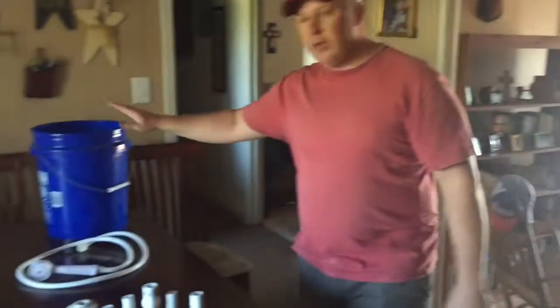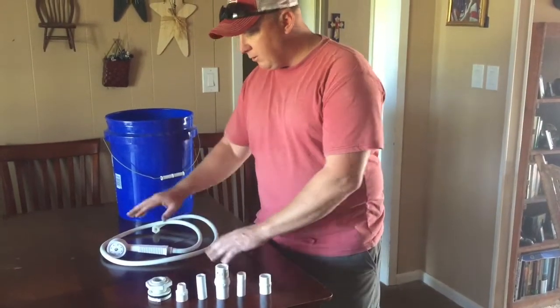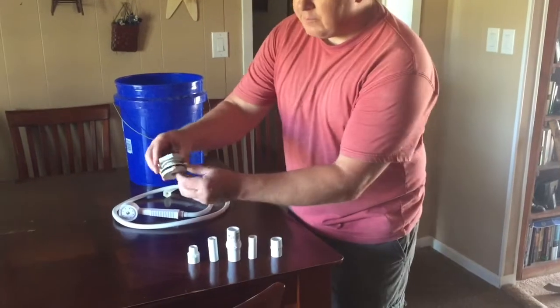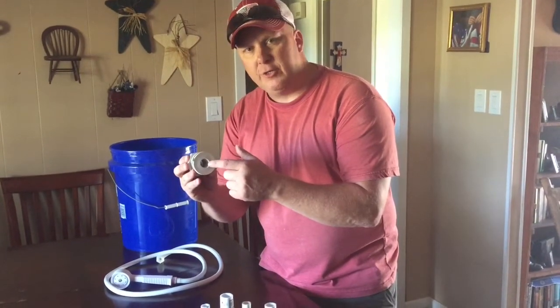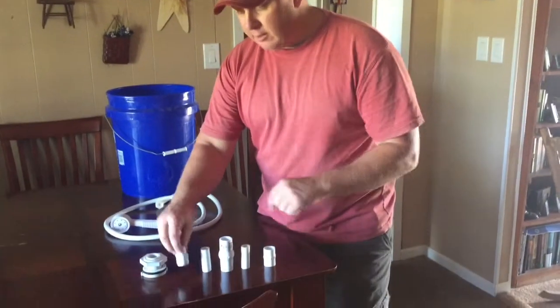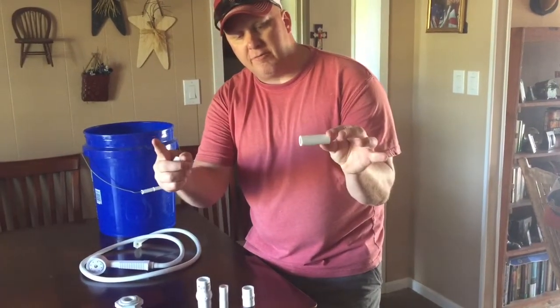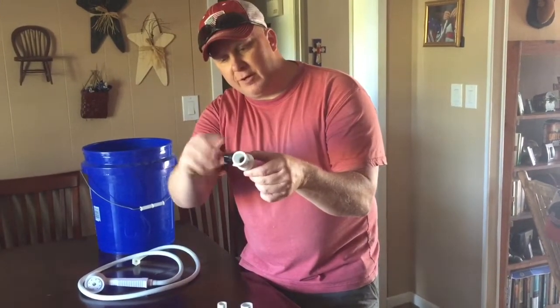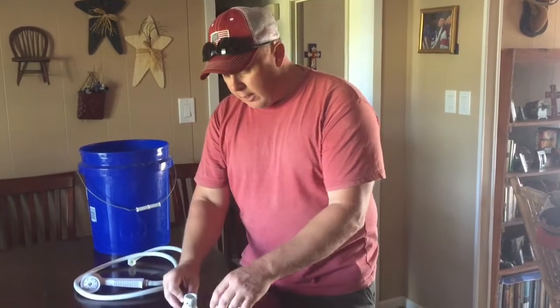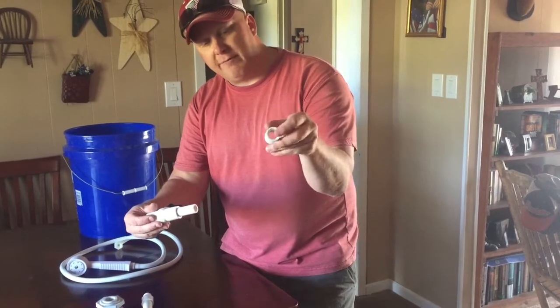I have a parts list to show you exactly how to do this. First, you're going to need a five gallon bucket. You're going to need an RV shower head, which comes with the hose. Then you need a fitting to drill a hole in the bucket — three-quarter inch outer diameter, half-inch inner diameter, that's the key. Then a half-inch inner diameter fitting with a small piece of half-inch PVC pipe, and a half-inch ball valve so you can shut off the water while showering. Then one more half-inch fitting with a screw-in half-inch on one end.